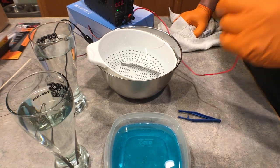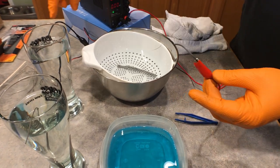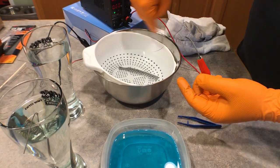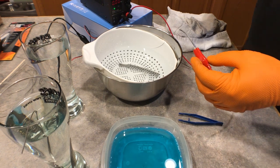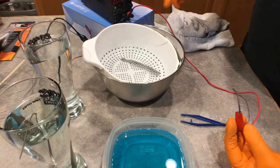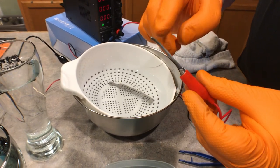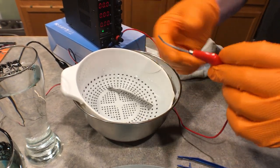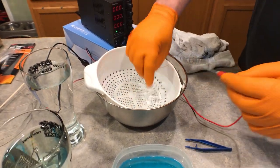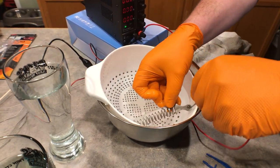My wife's holding the camera - I'm a videographer, look at me. You can see I've got my negative lead attached to the bowl. This is a stainless steel bowl and I've actually bead blasted the inside of it. I've got a plastic colander or strainer, and here is a little titanium rod in this alligator clip. I bent it a little bit so I can kind of hook parts. Let's see what happens - I'm just going to stick my part right on here.